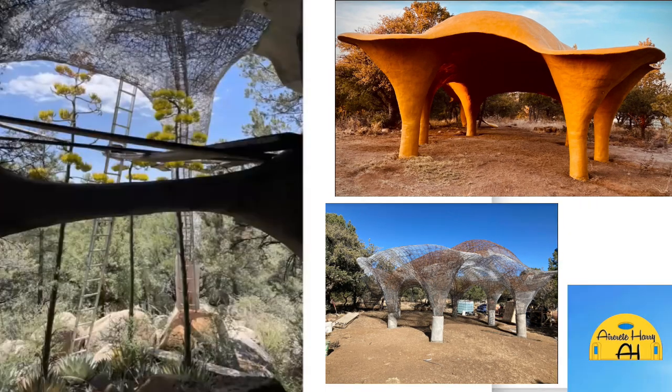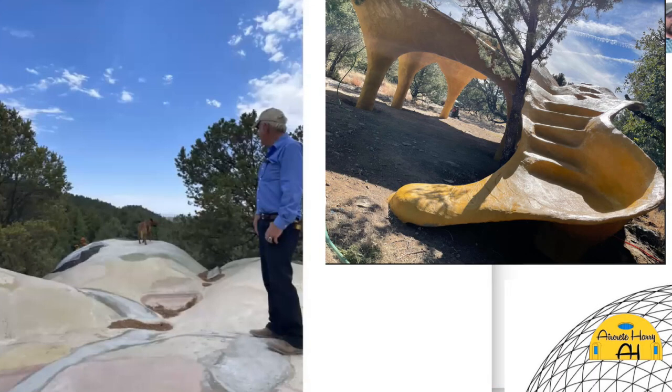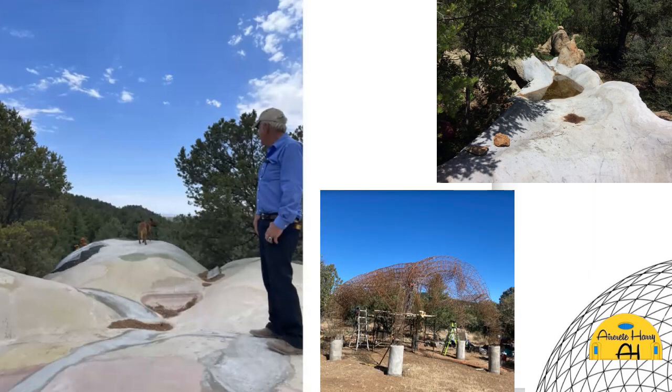How thick would you say your structural layer is? Your cement layer, how thick do you apply that onto your lath? Yeah, that's a good question. I do two coats, and I used to think I really had to do one coat to avoid that delamination. But since this is a low shrinkage cement, because it has such a little amount of water, you get incredible bond strength between the layers, particularly if I do the rake scratch.